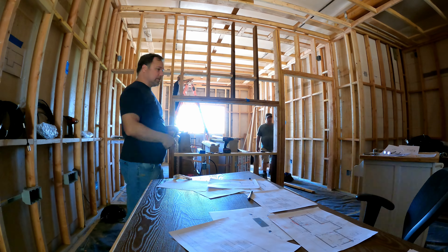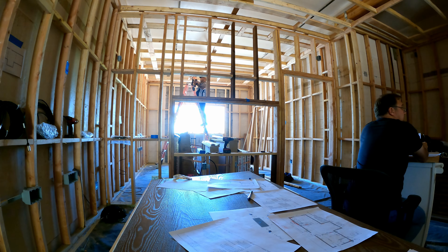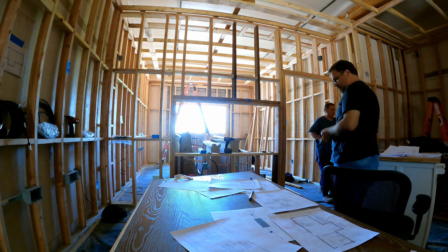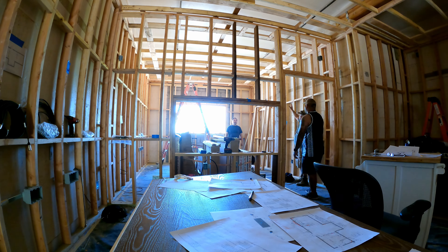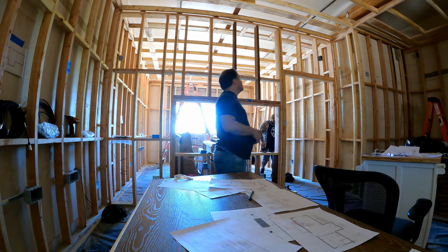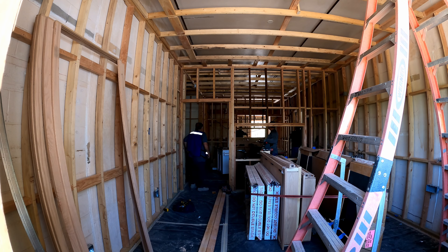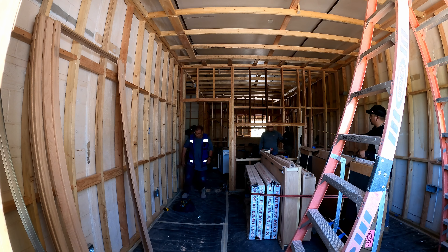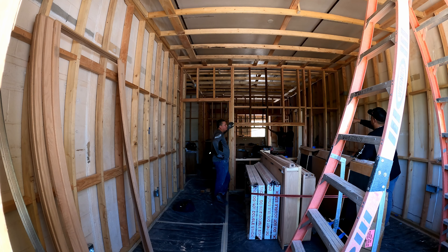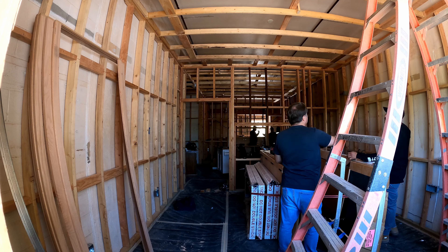One of the things the client wants to do is get the control room up first and then worry about the other rooms. I understand the priority, but there's drywall dust everywhere — it will get into everything. So let's finish the drywall, get the whole place painted, get the flooring done. We don't want to put any consoles in the way because then I can't get my ladder to get the acoustics up. Pennywise, pound foolish — you really need to finish all the drywall, finish all the paint, finish all the flooring, get all the acoustics up and the speakers installed and everything that's in the walls done. Then if you want to prioritize the control room, great. But drywall dust will get into everything and will mess your audio up. There are certain things you have to do in a certain way, and we're going to try to keep on task to make sure that happens for this install.